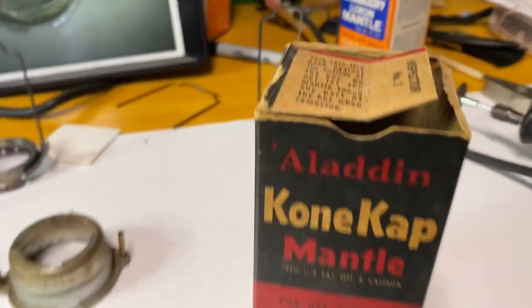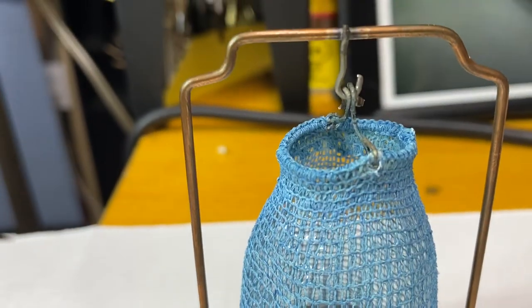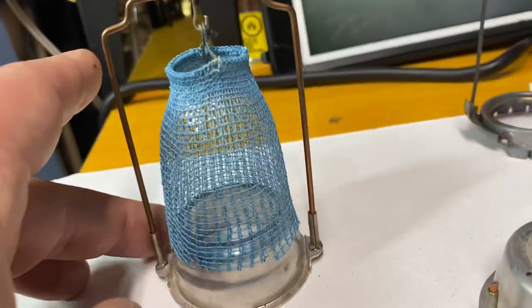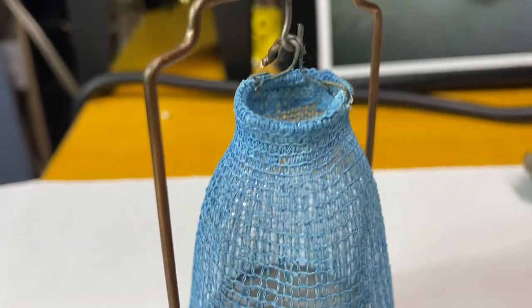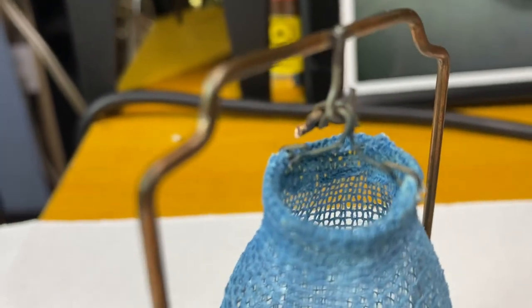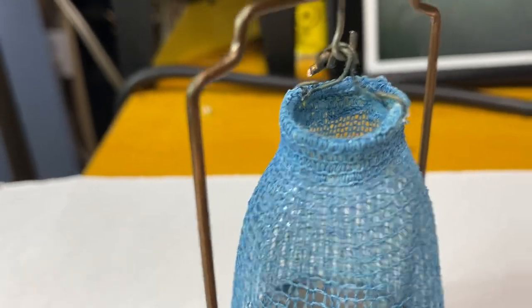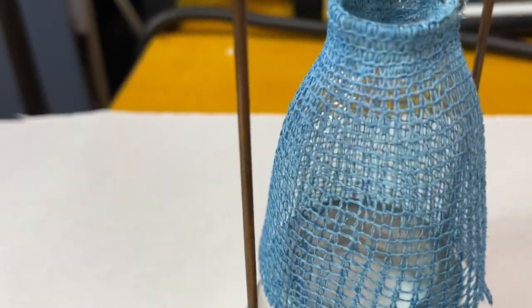On this particular style, if you take a close look, it actually has a hook. It's pretty simple — you have to insert a little lever in there to open up the hook a little bit. I used a pick to open it up. Then you take the mantle and you have to modify it carefully. You need to support it with needle nose pliers before you start bending it, or you're going to change the diameter and break it. You've got to hold it and sort of peen it together, twist it, and then loop it over.